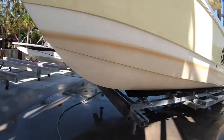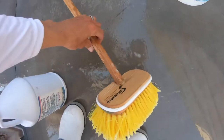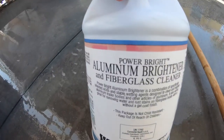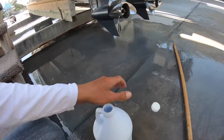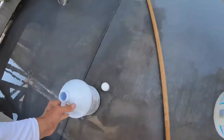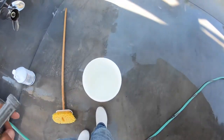So what you need in order to get your yellow stain off your boat is a brush — one of these soft ones. You don't want a stiff one because it's going to put hairline scratches in the boat, but Sure Hold makes a really good one to use. The chemical we use to get it off is called aluminum brightener. Here at a marina we call it acid, but there's some other stuff too that works. You only want to put about an inch deep of the aluminum brightener in the bucket, then close it back up and fill it with water to about a quarter deep using your water hose.